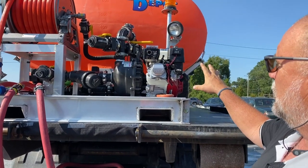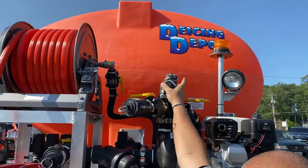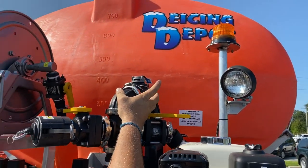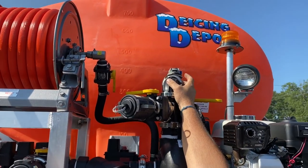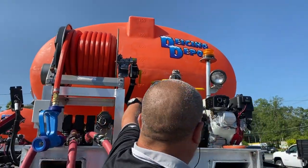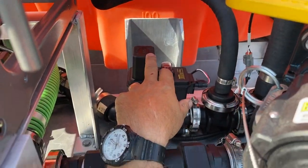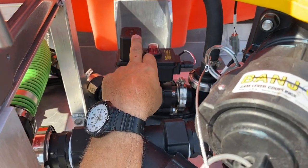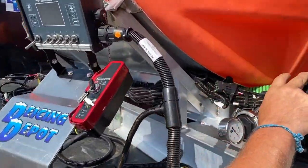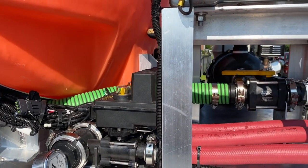Some things to note before going into the offload and load positions. You have a flow meter on top here — this counts your water and tells you how much flow is going through, giving you a readout on your screen. The flow meter is reversible, so if it stops working you can take it out, turn it around, and you're back in business. You also have a servo valve that opens and closes based on your ground speed to let more or less brine flow out, controlling the three valves here. The servo valve controls the flow coming through to give you more at your boom.